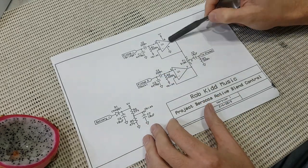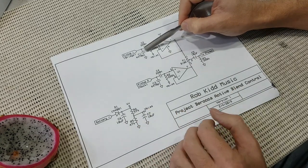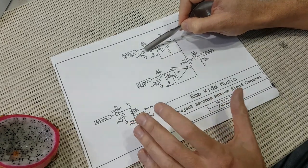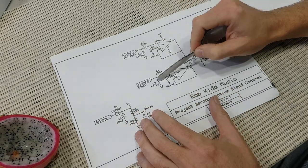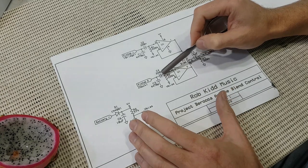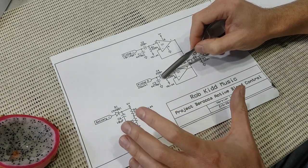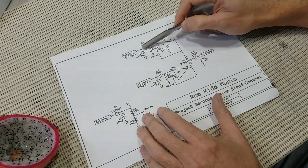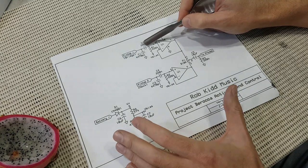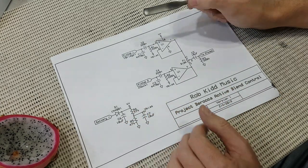Onto the buffers themselves, C1 and C3 are optional. These are there to simulate the capacitive load of a typical guitar cable. For Berocca, I'll have a cap on the neck pickup that I wound in the last episode, because I want this to sound a bit more like a passive Fender pickup, but I'll almost certainly have no cap on the bridge pickup, because the old Stingrays have their pickup directly coupled to the preamp, and that's a big part of that bright tone I'm going for.